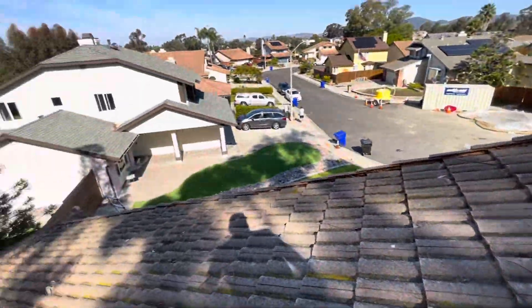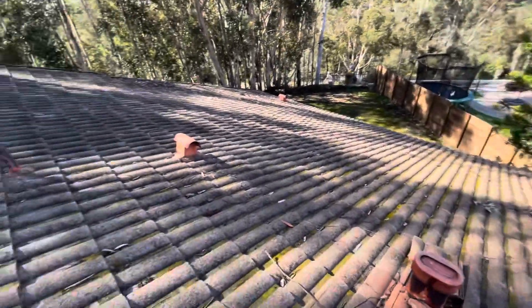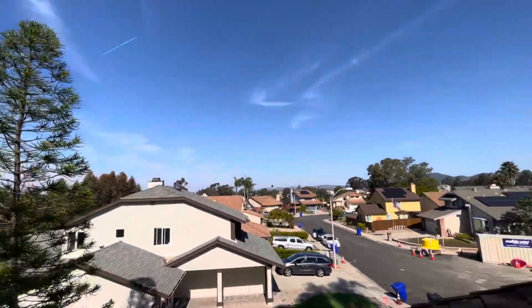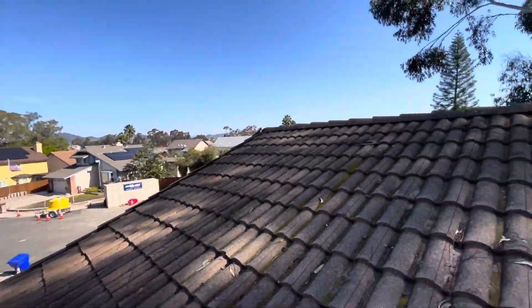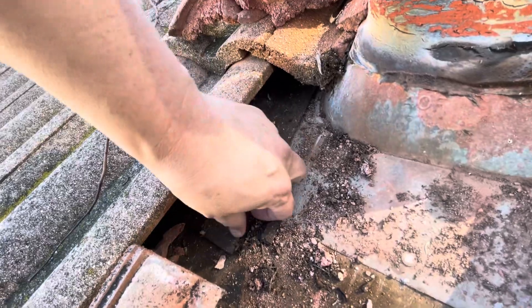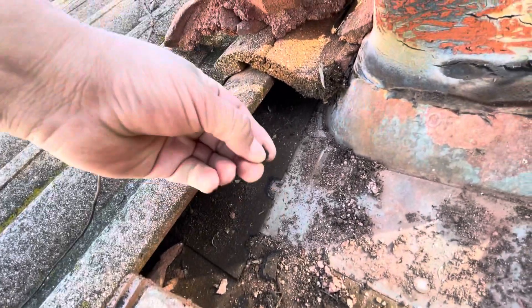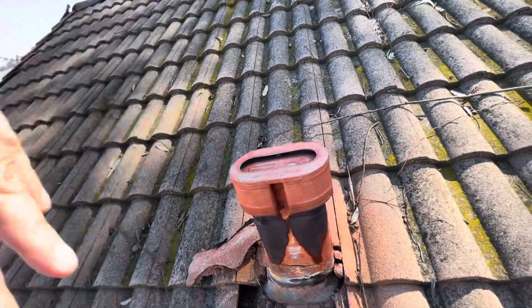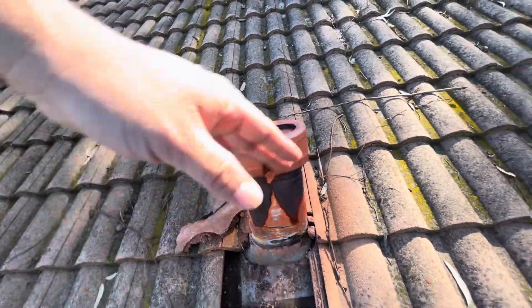See, that's a cracked tile right there. And right here, where this T-top is, there's actually a loose tile. I'll put it back. But you can see the underlayment now — it's only one layer of the UDL-40. It's easy to really tear off. Water is getting through here since this area was open already.